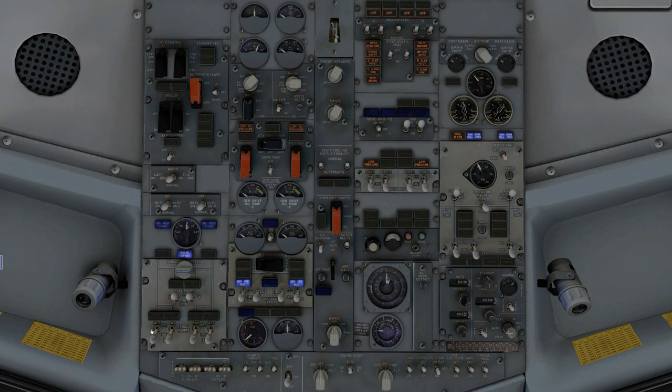We'll check the cross-feed valve and turn these fuel pumps off. Cross-feed valve is working fine. I'm gonna leave that fuel pump on for the APU because we are gonna be using APU power. Battery is looking good, 24 volts. No draw on it. Switches are fine, inverter is fine, APU is giving 120 volts, 400 hertz, wonderful. Galley's on, everything over here is guarded, drive temp is on. And the ground power here is off, obviously, because we're running on the APU.